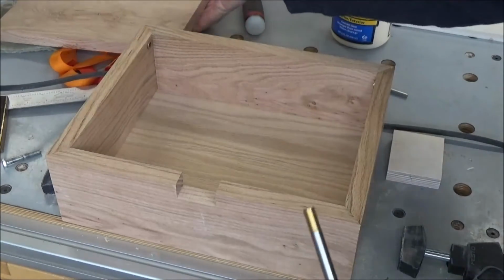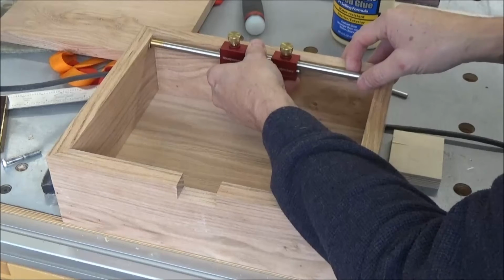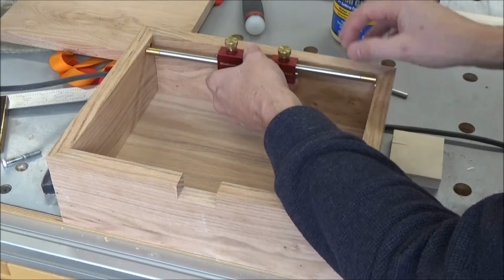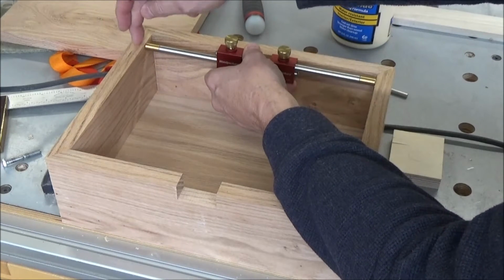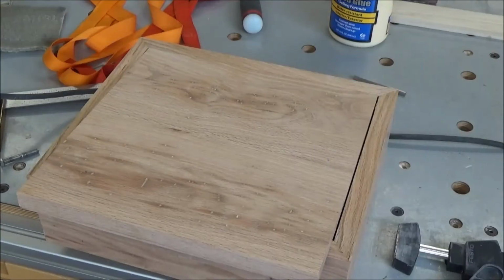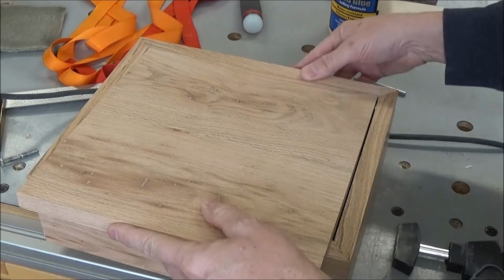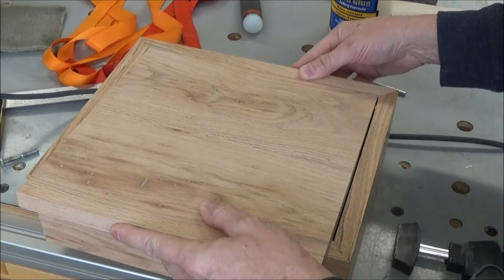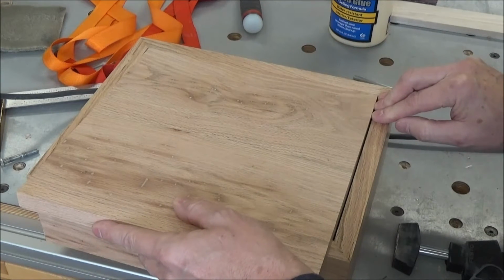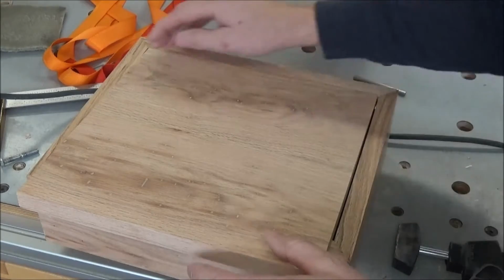So anyway, what I want to do next is size this lid to width. So I've taken a measurement of the distance between the bushings. I can't tell you what that is. But actually I shouldn't say that. I've taken the measurement between the wood sides. So I'm going to be an 1/8 inch large. Okay, I got the top sized. It just fits. There's maybe a half a thousandths wiggle room in there. You can just hear it a little bit.